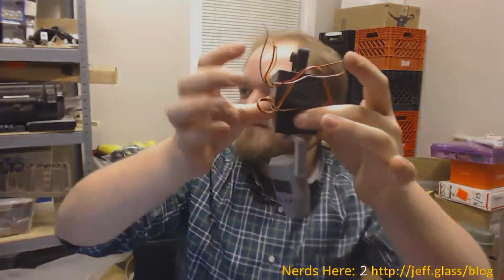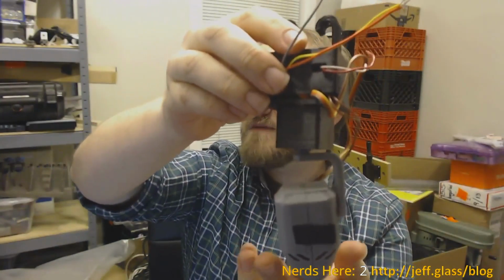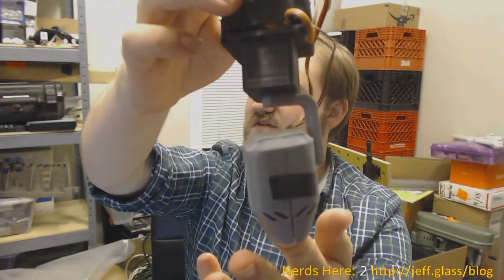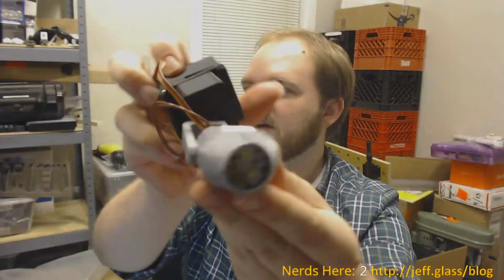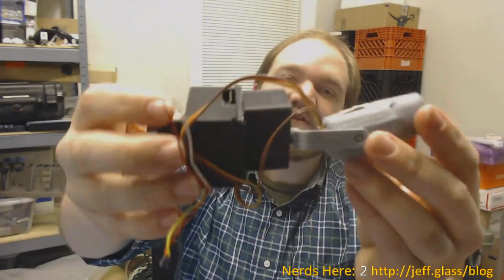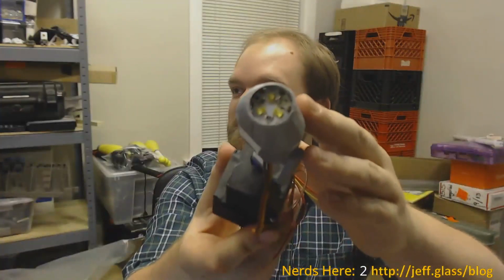The tiny moving light, for those who maybe haven't seen it, I wonder if I have a good way of showing this off. One of these little guys. So, still don't have a name for these little things other than tiny moving light. As you can tell, it's about 5 inches tall. Got a pair of servo motors in it, and an emitter in the front there. Puts out about 800 lumens, 1,000 lumens, so about as bright as a 75 watt bulb. And so far it's been fixed beam.